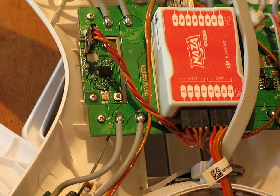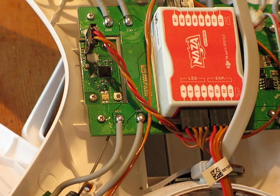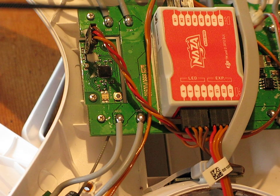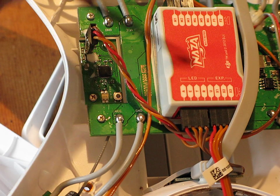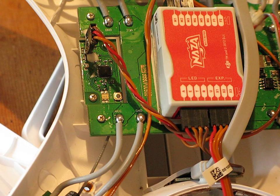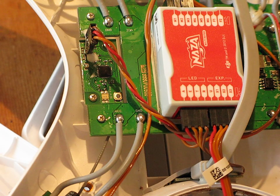Well, it's quite simple really. I can use a plastic pointer here — which is actually a cable tie — to show you. If you open up the Phantom, this is the receiver module here. You can tell that because the part numbers are on the circuit board here on this side. What you have to do is power up your transmitter first, and then power on the Phantom.